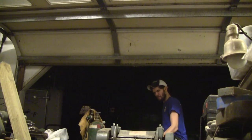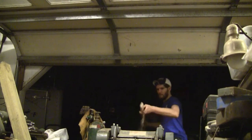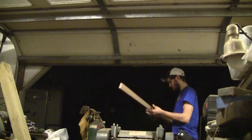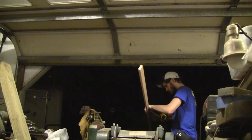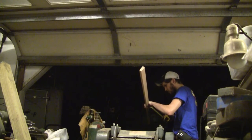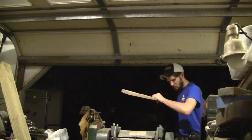Based on my previous experience, I know that the bow doesn't have to be more than about 5/8 inches thick. So here I'm removing some of the material with the planer to make the process go faster. You don't need a planer to make this bow, however. You can accomplish the same task with a hand planer, draw knife, or a rasp.